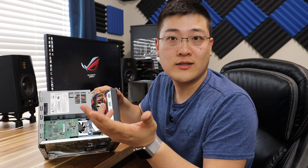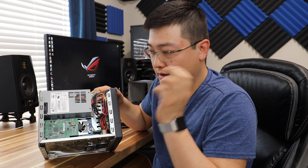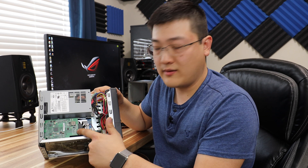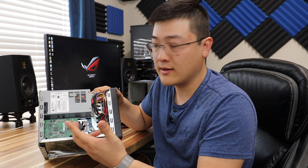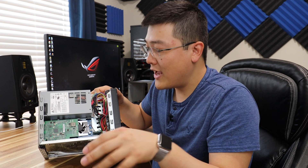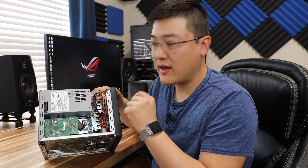If you look at all the X550 T2 network cards, they are passive. There's a little heat sink on them and they run passively. This is completely overbuilt for the card — there's a big piece of aluminum and a heat sink on here and it really doesn't need the fan. It doesn't need the extra cooling. So if you find that this is a little bit on the loud side, you can just pull that fan and it'll run just fine.